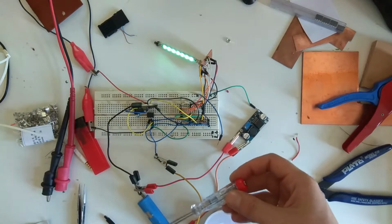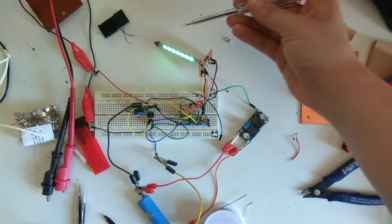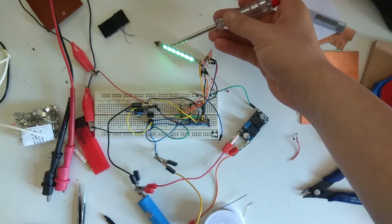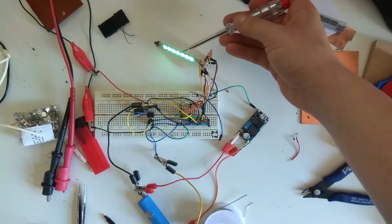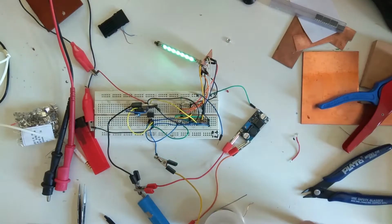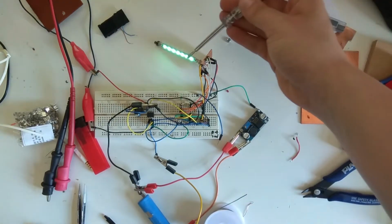As soon as the battery discharges, this will go off in segments. The first two will go down at first, then the second two. Then there's only these three here on. And once the battery gets to a critical state around 3.4, 3.3 volts, it will start flashing this bottom bracket.